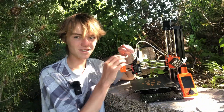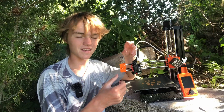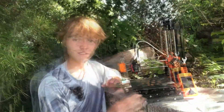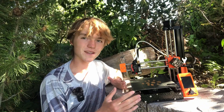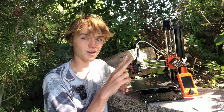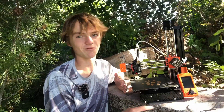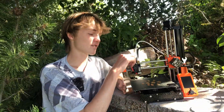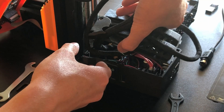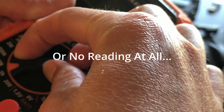Also make sure the sleeve is all the way on. You can do this regardless of whether you currently have this problem, as it could come back to bite you later. The rubbing won't be immediate — it's just over a long time that friction buildup starts wearing it down. This is part of the reason why the first Prusa Mini I got, which was semi-assembled, already had the wires assembled correctly. The other two printers I assembled myself, and that's where the issue came up. For the heat bed, I just bought a new one as the wiring had ruined the entire heat bed. If you're getting beeping and there's no clear sign, you can also go into the wires with a multimeter and press them down — if you're getting a really high reading, there's more than likely an issue with the wires.